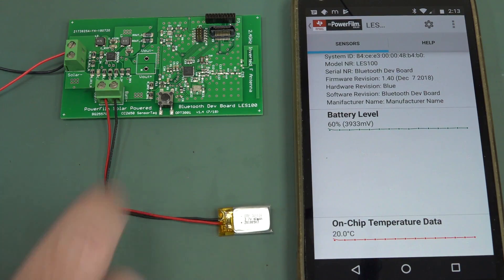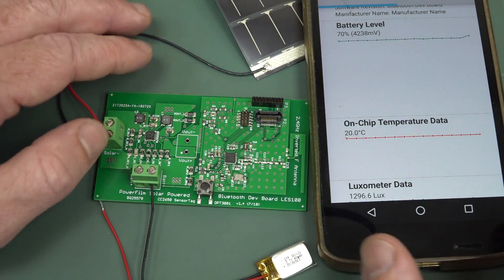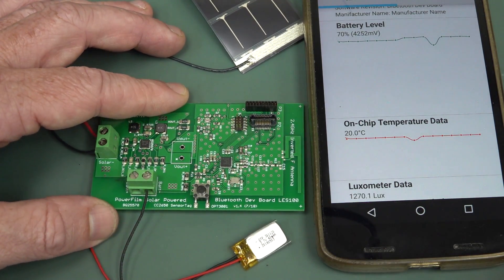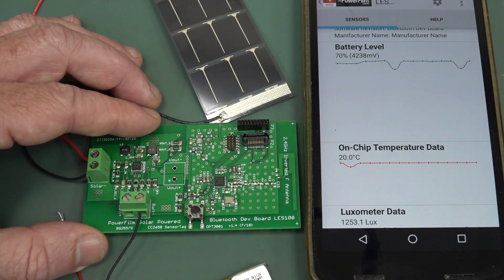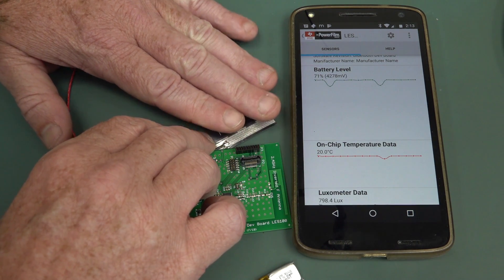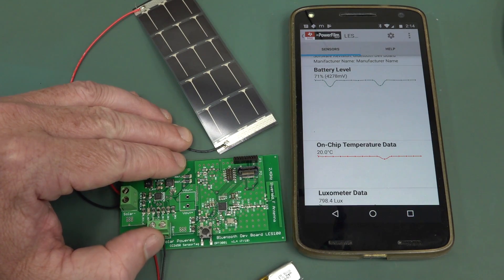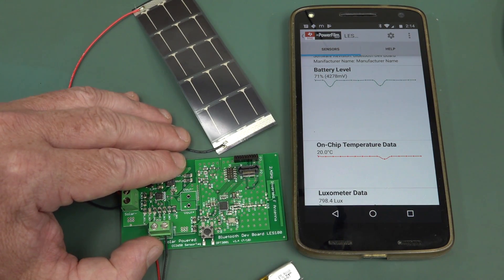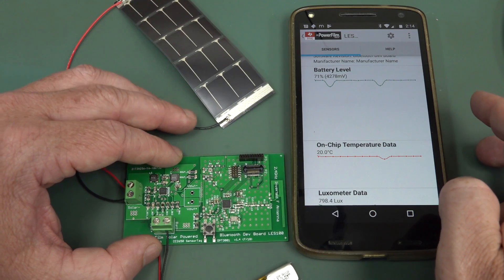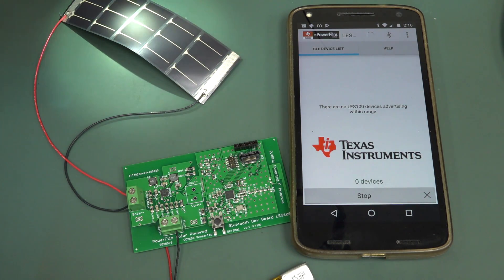It's all being powered from this. If we disconnect the battery, it won't work at all. Let's actually disconnect the battery and see if she still talks. Battery level - it dipped. But is that coming from the solar cell? Let's try it - we'll cover it. Yeah, it's not connecting at all anymore. Take my hand off. Is it going to reconnect? No - I think we might have had some capacitance on the board keeping it going, because it's not going to reconnect.